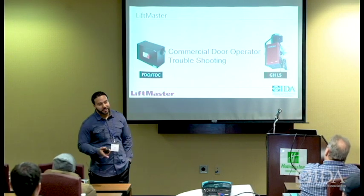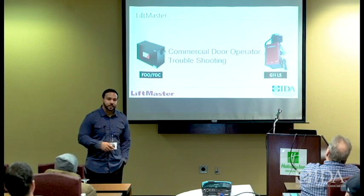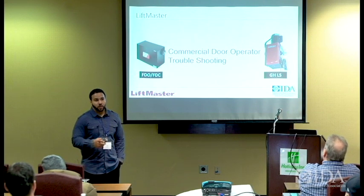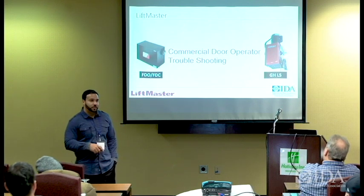So with that being said, I was out there, we did some testing and everything, and those units had been out there like 10 plus years. And if you change the batteries in them like you're supposed to, they were still functional, hardly any problems. The little bit of problems they did have wasn't anything wrong with the unit. They were running high voltage and low voltage in the same conduit.